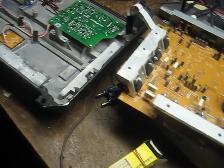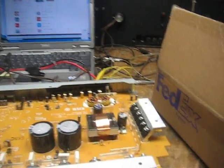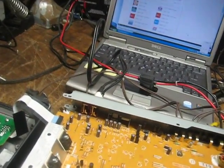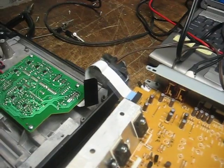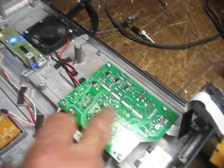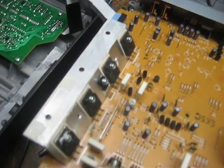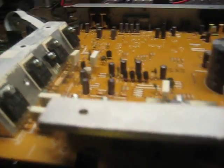I tried to use it and it did nothing but break up with a lot of distortion. So I popped it open, did a little digging around, and what we found was the negative regulator for the 15 volt supply that feeds this preamp board had taken a shit — it's a little surface mount component.